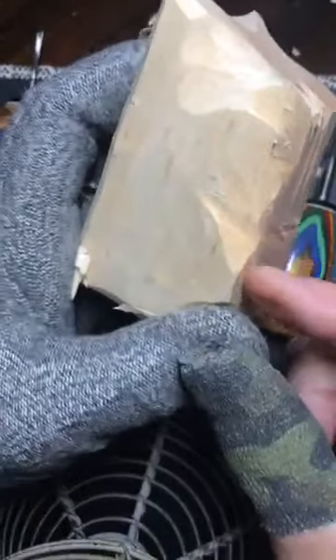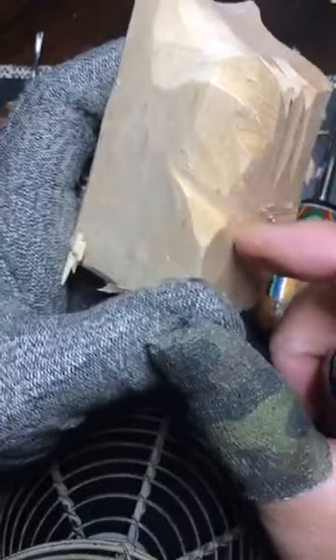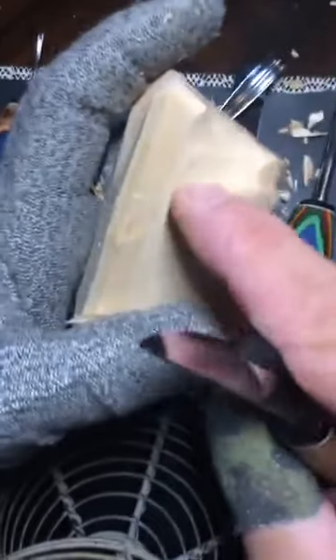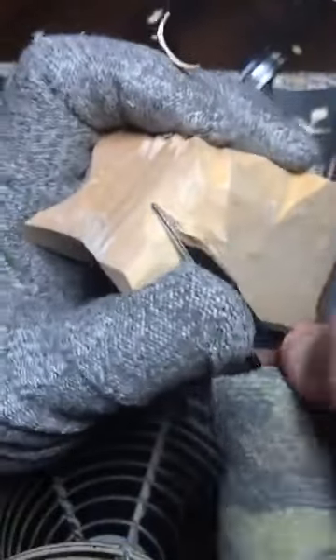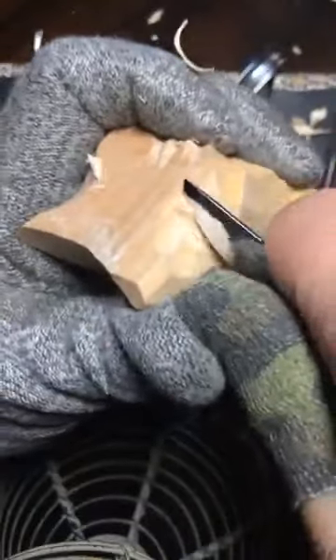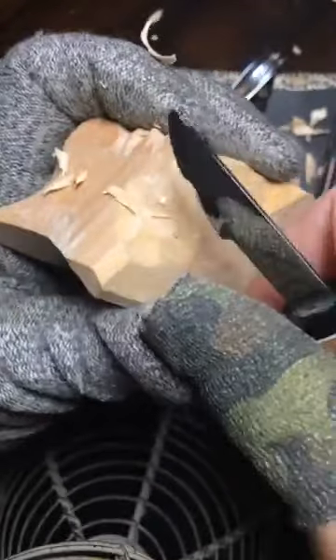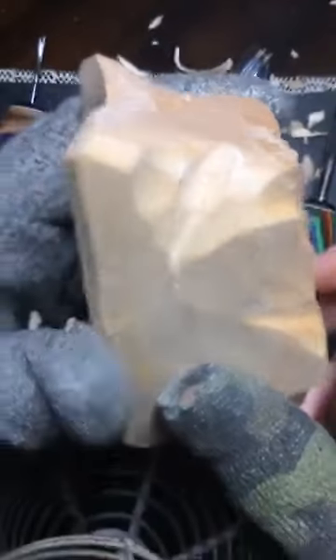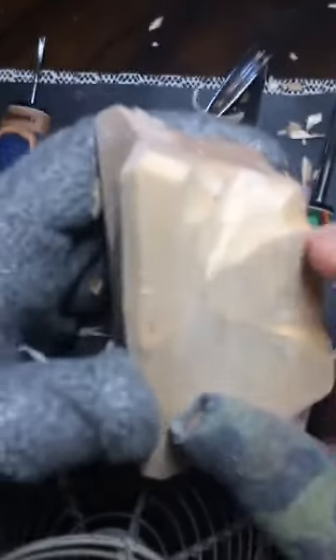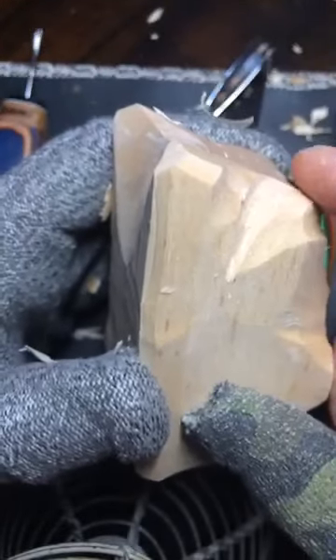So same way here — push and turn the blade as you're doing it. This would be the back of a pant leg or something like that where you want that nice fold in there. You're not using the gouge to just push it through. Here's a flat spot where if this was a concave or a curve between a separation point where I wanted some texture — you still have to allow for wood grain — but again, push and roll that knife up through there. And now you don't have a hard V-tool line.